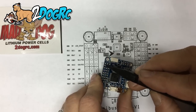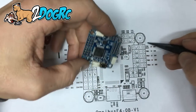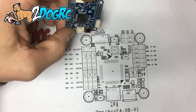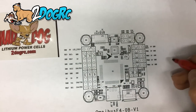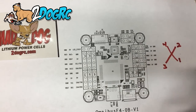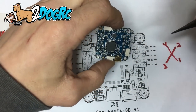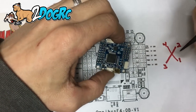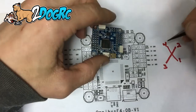You've got buzzer right next to it — buzzer plus and minus. Again, this is all on our website. Your receiver is here, and here are your motor inputs — solder 1, 2, 3, 4. It's good to have a little diagram of which is which on a quad. We've got motor 1, motor 2, motor 3, and motor 4 — that's how you're going to wire it. For grounds, you can debate this all day. On this board I did connect them, just because I had them already wired. I soldered all my ground wires together into a big ball basically, then had one wire come off that and go into one hole, just to make it easy.